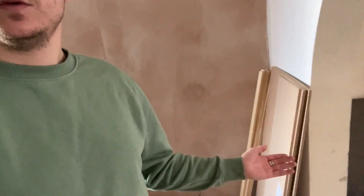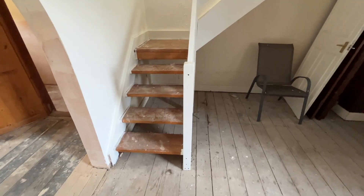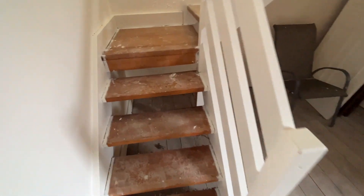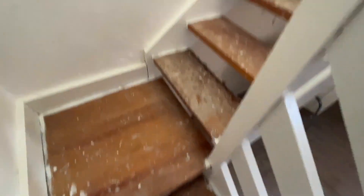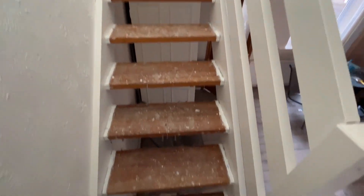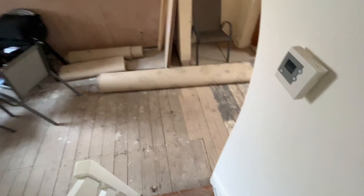So it's now Saturday and you will have seen that I went to B&Q and I got this wood here, and that is because I'm going to be doing some work to the staircase. At the moment the risers are open but non-existent - we just have the treads - and I don't want that because this staircase is going to be carpeted. So I want to put backs on the back of each step. To do that, I've got some one-by-one battens which I'm going to fix underneath the risers.